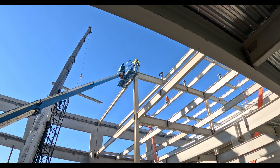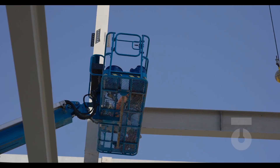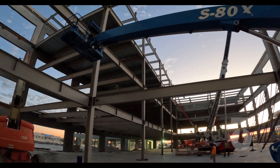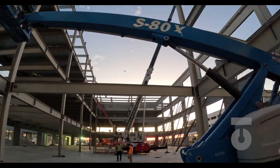This is where we give you a foundation for understanding this concept, as it is really important. Nobody wants a crooked building. So how do we plumb our building? Plumbing structures all starts with our columns. Our columns are what we need to pull straight so that our structure is plumb, and to do this we typically utilize wire rope cables and turnbuckles. Steel rod is also used.